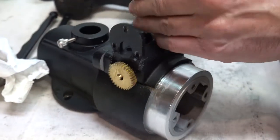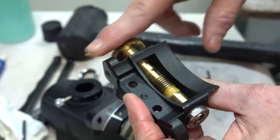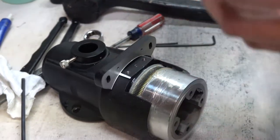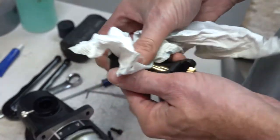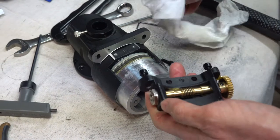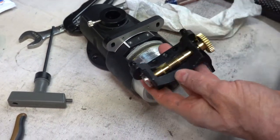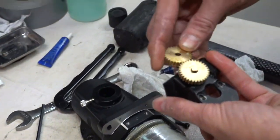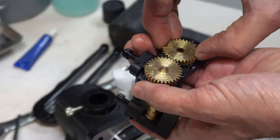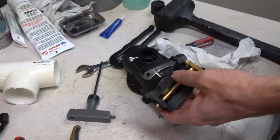This part here is the worm gear assembly. The motor turns this gear, this worm gear engages to these teeth, and that's what actually turns the mount. Guys, when you're discovering periodic error because of gear and backlash, this is where it happens, where this gear interface connects to the other gear interface. This is where your periodic error comes from, that engagement. This is where your backlash error comes from when the motor's in there. If these are too loose, one of them has to move a lot more. You want the teeth to be meshed properly, but not too tight. It's all a balancing act.